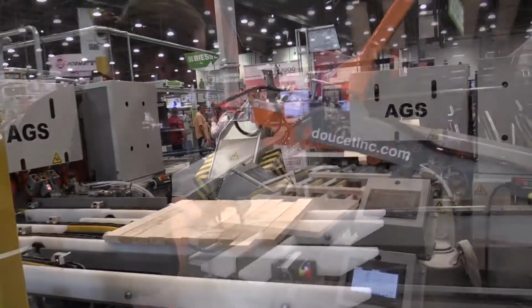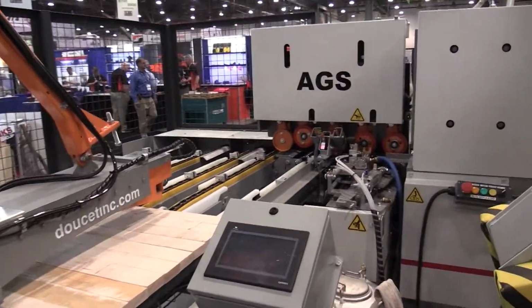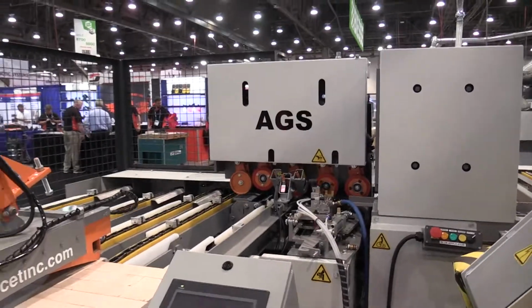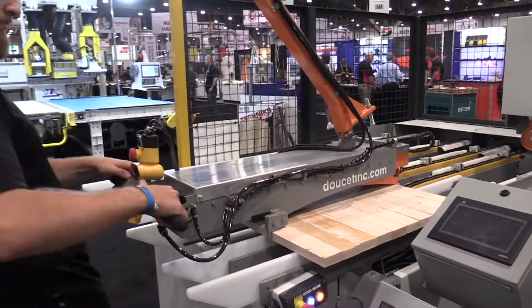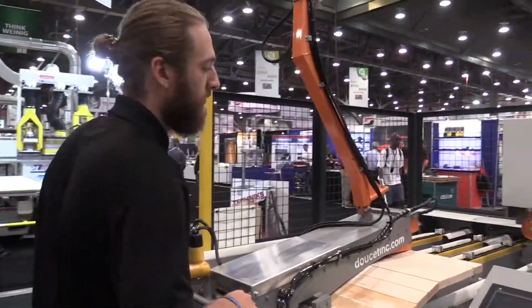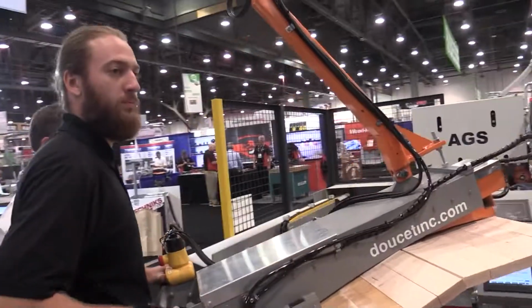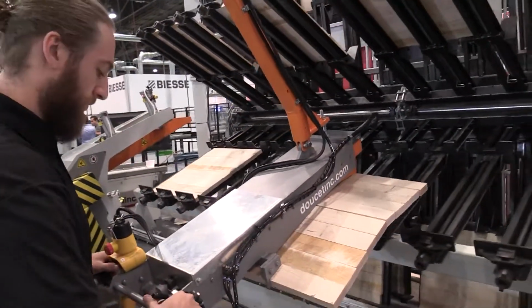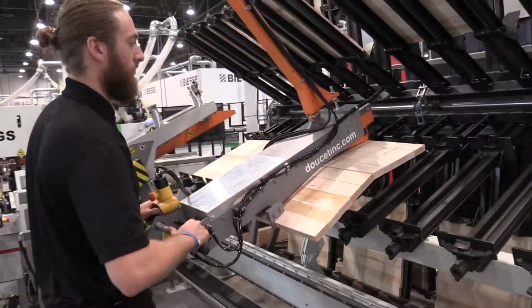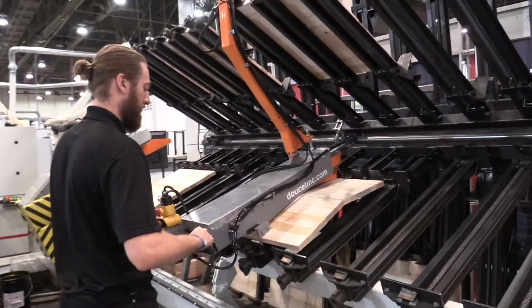The reason why the AGS is a success is that some users have told us they save about 30% of glue. Their cleaning time of the clamp carrier came down to almost zero, turning that cleaning time into operational time. They also save money on the abrasive by having a longer life on every sanding belt or planer knife. And overall, it's a much cleaner operation. Some of our customers did not even clean their clamp carrier even after a year and a half of operation.